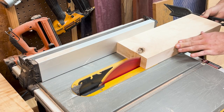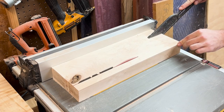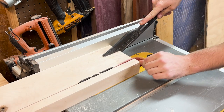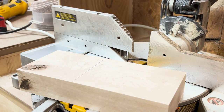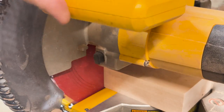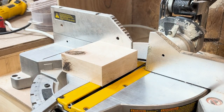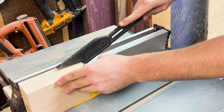After this, I cut the large maple piece to final width to use for the mallet head, which would be 4.25 inches with the thickness being 1.25 inches, just like the handle piece. I needed my final length for the mallet head, and at the miter saw I cut it at just over 5 inches. I cut two of these because I would end up cutting one in half to use for the outer sections of the mallet head.